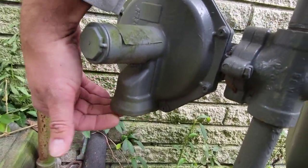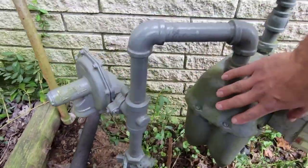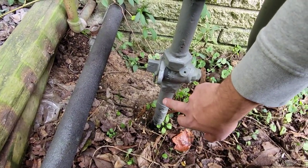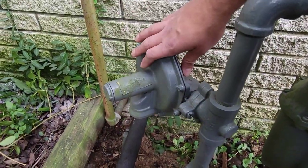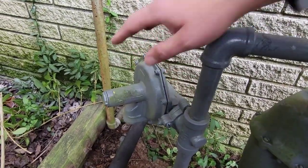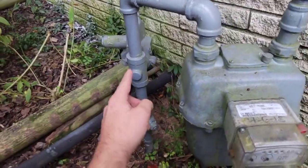This right here is a little vent. If you ever smell gas outside at your meter, it could be coming from this vent. This right here is the riser — we should have around 40 pounds of pressure coming in. This right here is our shutoff. After our regulator, we reduce the pressure below a pound to about 7 or 8 inches minimum water column for natural gas coming in to the gas valve.